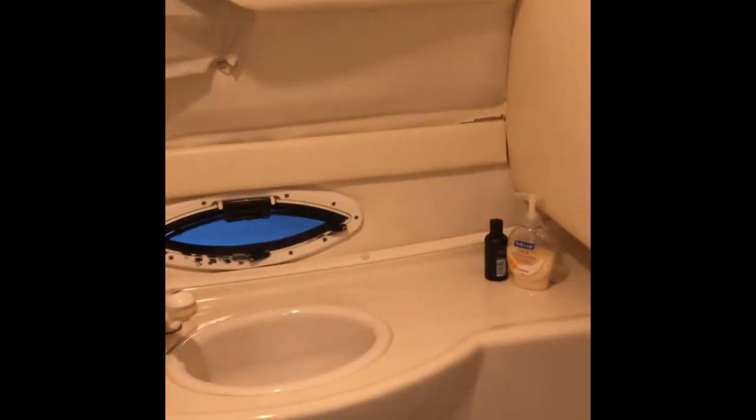Another upgrade: I replaced the standard hose plumbing with PVC plumbing a few years ago. The hoses will foul and need replacement, but the run on this boat is short enough that you can use standard PVC piping. Because of that, you're never going to have smell issues from your plumbing. There's the toilet and the pump — turn this off. You've also got a mirror in there.